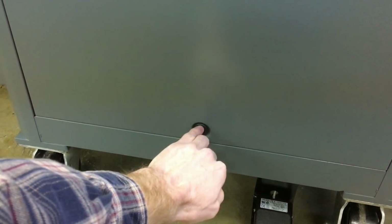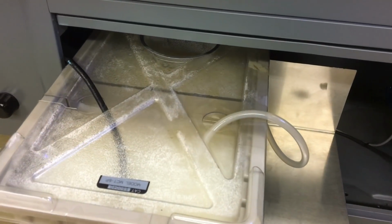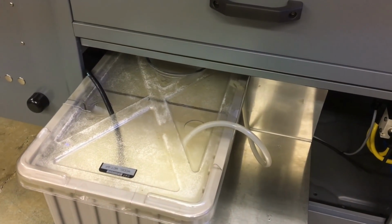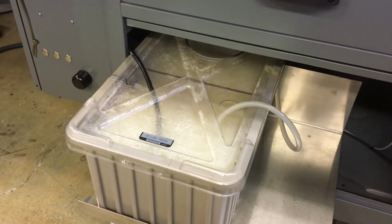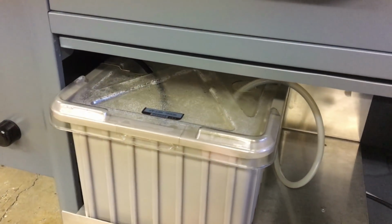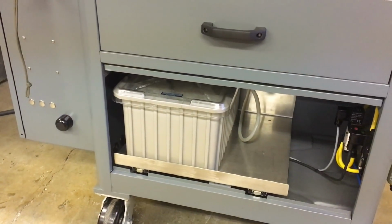Let me open the coolant here. So yeah, I just eyeballed up a couple gallons of coolant. I don't have a Brix meter to do it proper, but maybe Santa Claus will bless me with one. But definitely a little on the greasy side. But yeah, I ran a couple test cuts dry, and there's definitely a big difference between lubrication and none. So yeah, no crazy leaks.